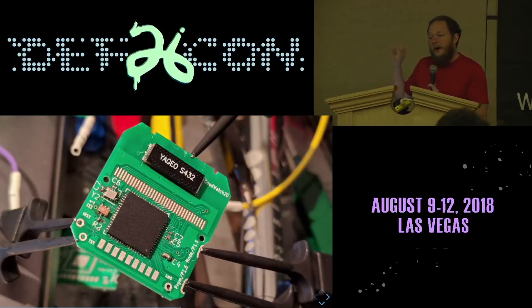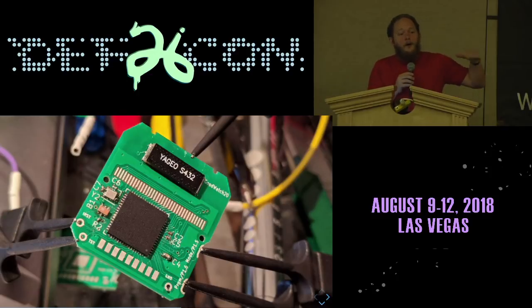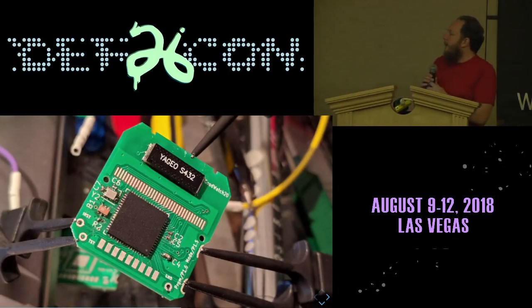It can also dump a copy of RAM so that I can do core dumps from a running watch in order to load a real RAM image into my debugger to see what particular variables were. Or I can dump the dmesg log. So when I run printf, there's no room on the LCD to cover the full kernel log. So instead, printf just writes to a memory buffer. And by dumping that memory buffer out, I can use printf debugging to see what went wrong.